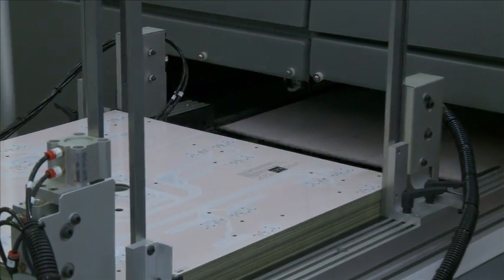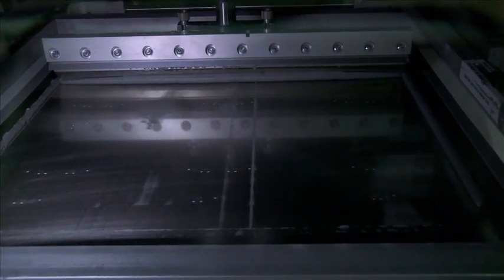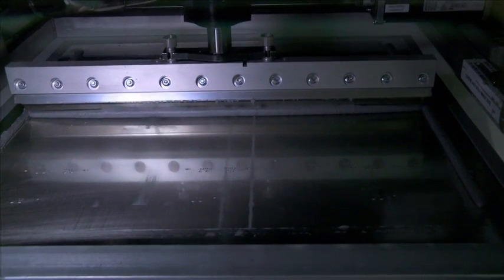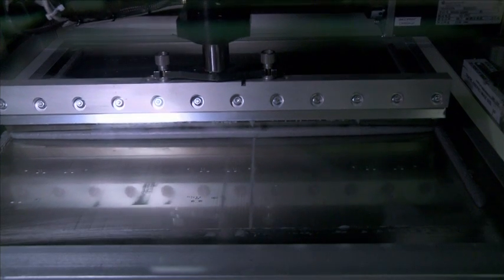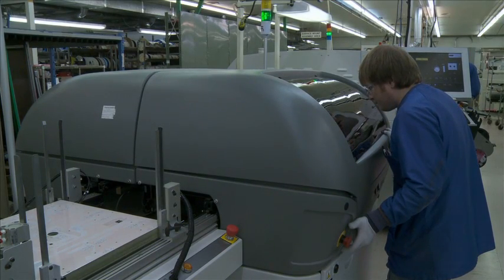This is how LVX Western's 2x2 replacement light is assembled. The boards come into this first machine on the assembly line, and solder paste is squeegeed onto a special mask with special holes. The paste fills in the holes in the mask where the components will be placed in Stage 2.